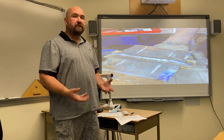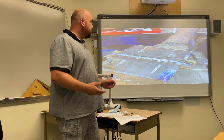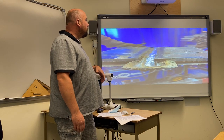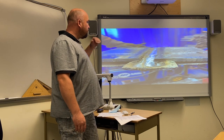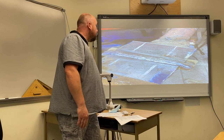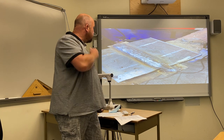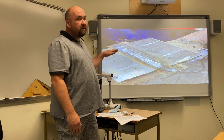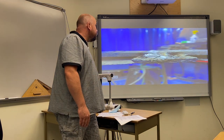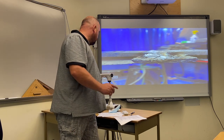It's okay to have a mistake or a failure when you're doing your testing — it's not the end of the world. Here looking at the plate from the edge, you can see how I've filled up to the top edge. There's my cap completed. I'm not over my eighth of an inch — you're allowed one eighth of an inch as your maximum height and minimum is flush. There's an end view showing I'm at least flush and a little bit positive, which is exactly what we want.